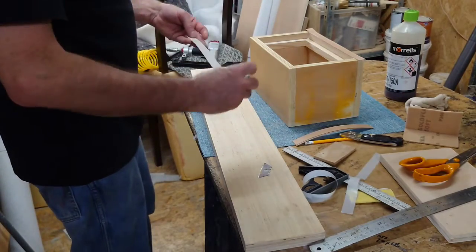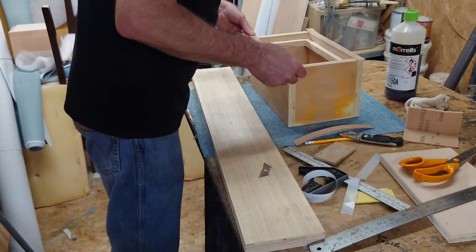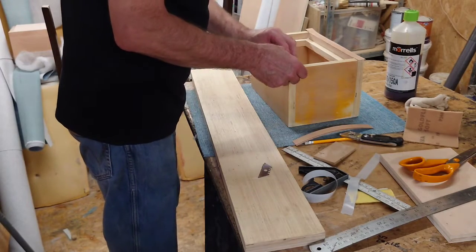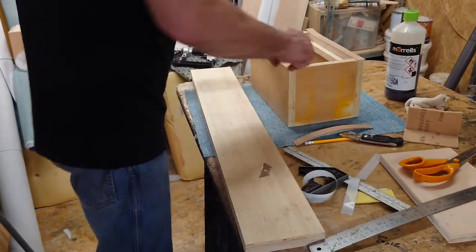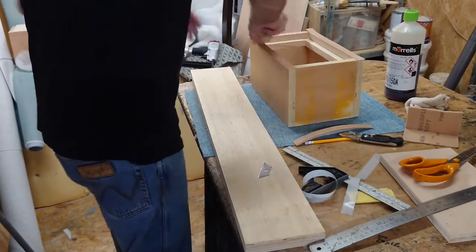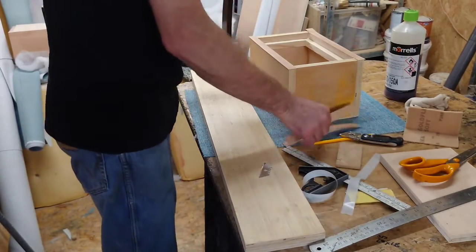So we just pull that back like so there. Pull that off, and you will see the reason why I've left those end pieces on. So we want to just offer that up again and get it just over the edge very slightly, just so we can sand it back. There you go, that's perfect. Right, now this heat resistant special powder polish dries really fast, especially in this heat, because it's alcohol based. So give it some really good rubbing down there.